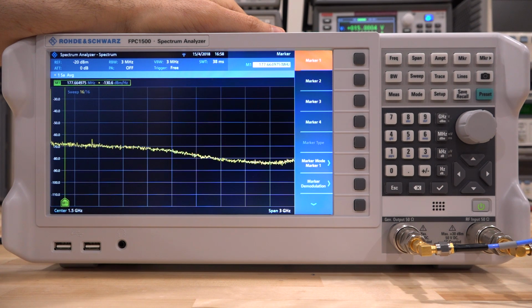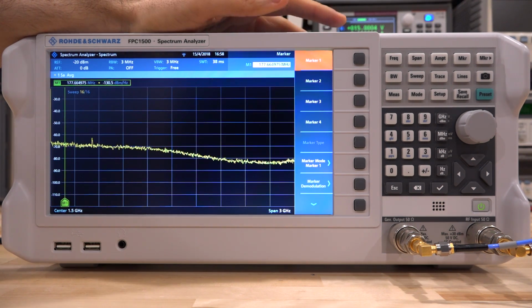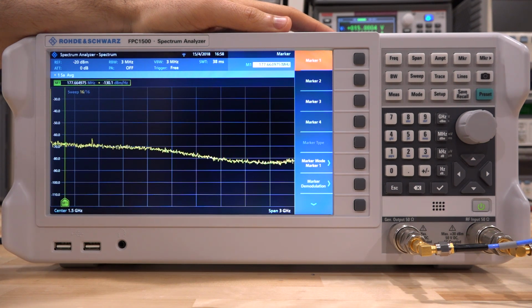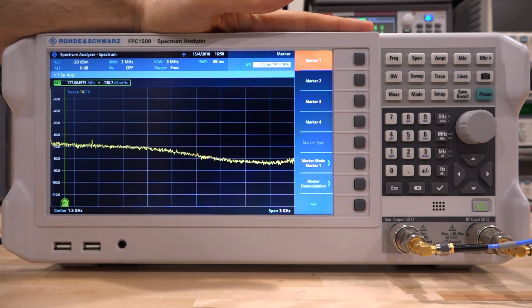That sounds pretty complicated. So what if we modulate the gain control with an external source and then measure the demodulation directly on the instrument itself in AM demodulation mode? If I were to modulate the gain control of the amplifier, I'm going to change the output amplitude, so it's going to look like AM modulation. Now this can do direct AM demodulation depth measurement.